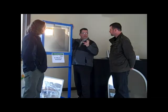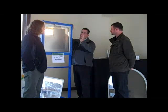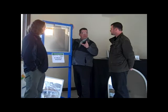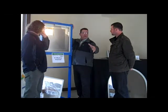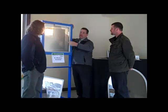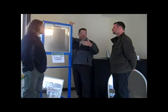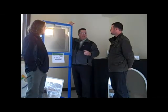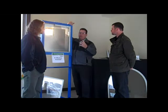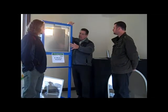People have a little bathroom exhaust fan always going out. When you first move into a brand new home you heard the vent open, but after a while you never hear the vent anymore. That's four inches of air leaving your house constantly. Then you turn the dryer on — those super high-speed dryers suck air out of your house. Where do they get that air? It comes through cracks, windows, and sliders. We put these inserts in and now they have to get air from a makeup air system — it exchanges heat and pressurizes your house with fresh air through your furnace instead of sucking it through the windows. We do a free energy audit and walk you through simple things like the exhaust fan and your doors — a lot of people never knew that was wasting a ton of money.